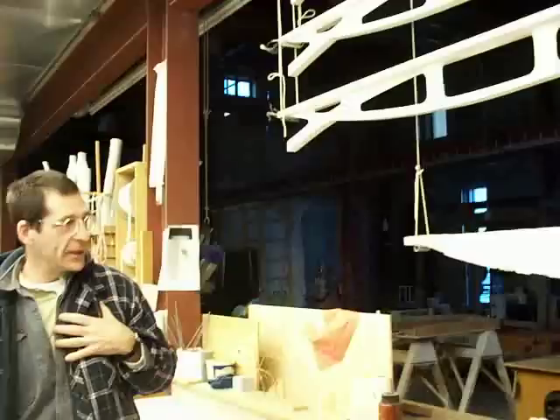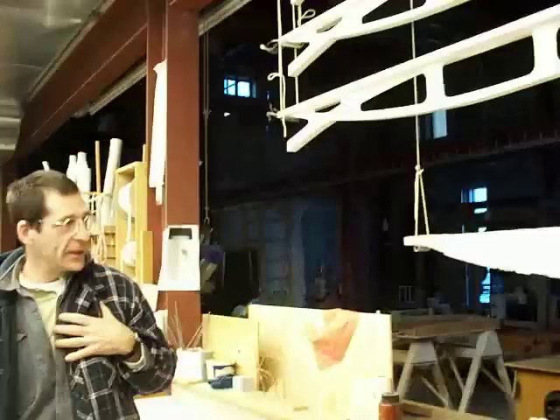That's the Y column outside. Now that we can cast these curves very economically, we can follow the bending moment curve for any beam. What happens when you follow the bending moment curve is extremely interesting — it opened my eyes to certain structural truths. My whole education, taught by Israel Sane for four years, was great but all based on uniform section structural methods. When you change the section, things are altered significantly.